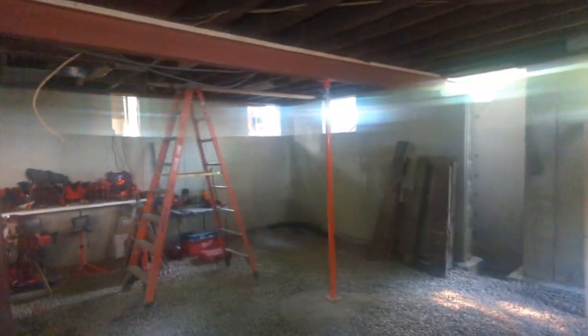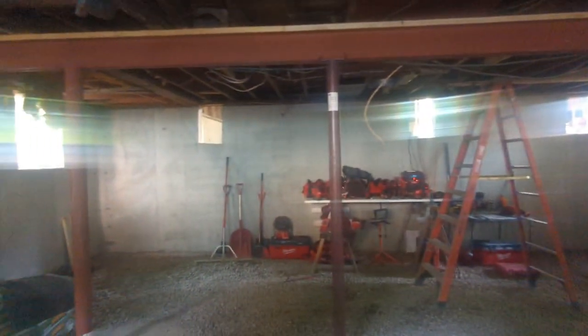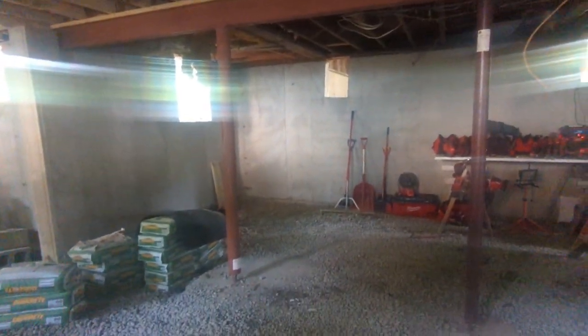But for now I can see all the electrical, and I've got that old beam cut out of the way. And what was the point of that? Oh, now I can cut off the plumbing stack, which can now come straight down. And looks like the double joist had to be. This is all kind of convoluted here. These joists aren't getting to the beam. So I might strip a lot of this stuff out and sister over onto the beam at least here.